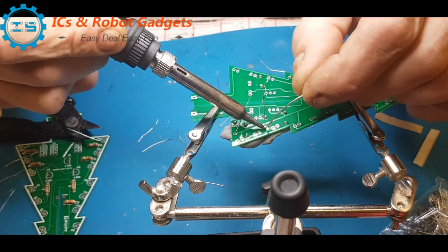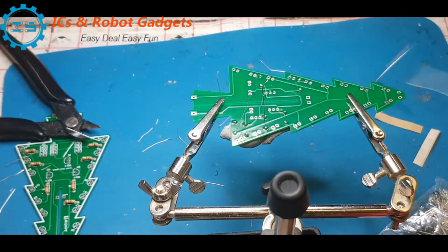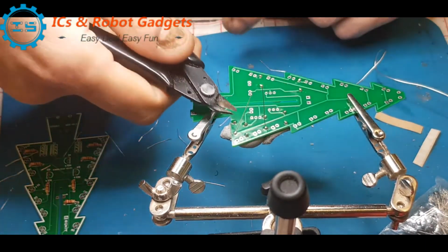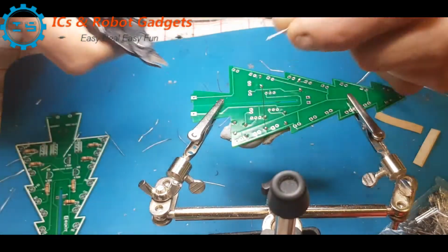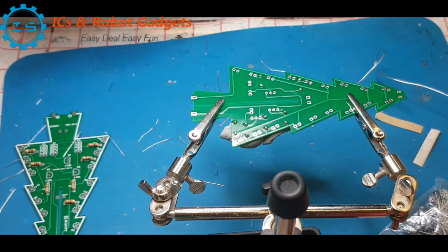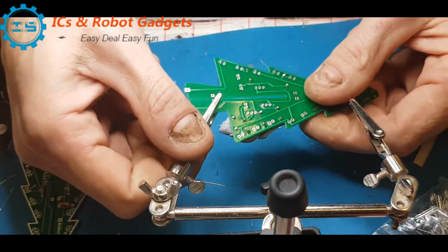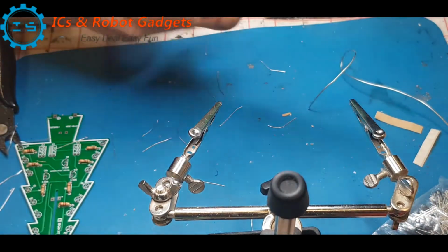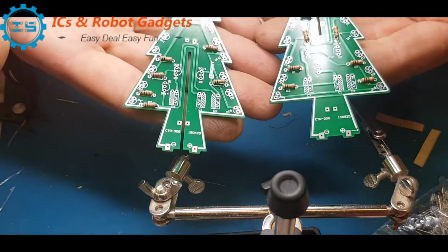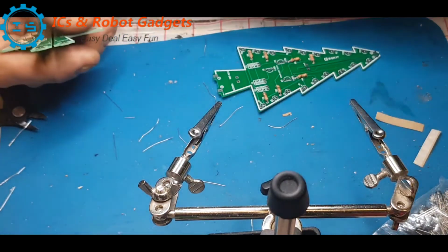This is near the end of my 1mm solder, and to be fair, I'm getting quite into using 0.6 or 0.8mm solder, especially with the SMD work. This 1mm is alright, but right, we want to save one of these longer legs. I have got other wire for this, but you'll see why later. I'll see if I can do it with that. I might try other cable that I've got. So there we go. That is our 2 resisted up boards. I might just have a look at tidying these up a bit.